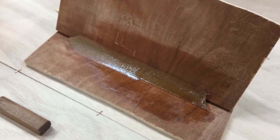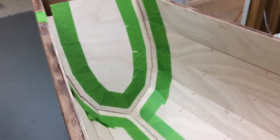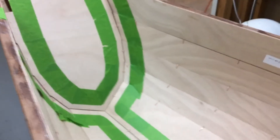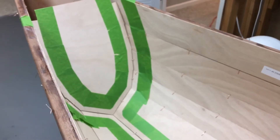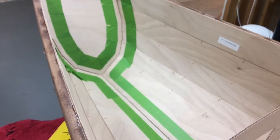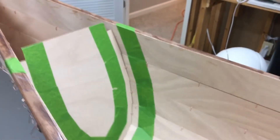I'm trying to get these fillet lines as sharp as I possibly can. As we go up into the bow you can see that I've taped everything off. A lot of filleting is done freehand and some people are very good at it, but I like the tape lines and I want a really sharp edge. One problem with the filleting process is that since you're using epoxy resin thickened with wood flour, you're going to get a fillet that's this color — very apparent. Any wavy lines or sloppiness can only be remedied with a tremendous amount of sanding. Even though all this tape work has actually taken me several hours, I'm certain it's going to save me a tremendous amount of time.